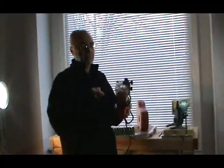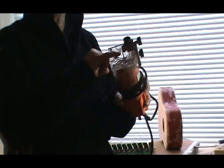And the way I do that is I use a laminate trimmer. This one's from Harbor Freight, but any good quality laminate trimmer with a good carbide blade should be able to cut that ledge or rabbet or rebate in Anglo-Saxon English. So you need a trimmer with an edge guide and a good carbide bit. This one's called an end mill. It's got a 1/4 inch shank and a 3 millimeter or 1/8 of an inch cutting bit.